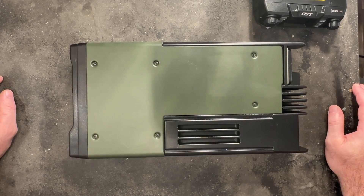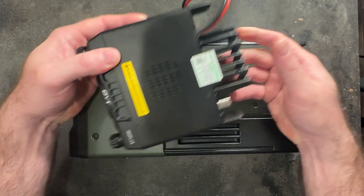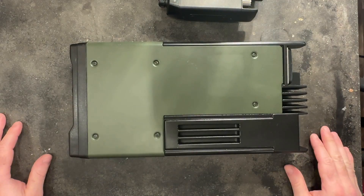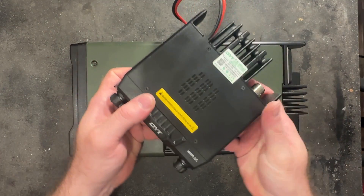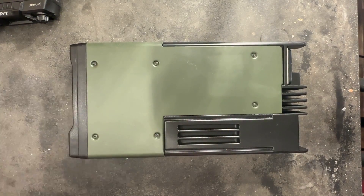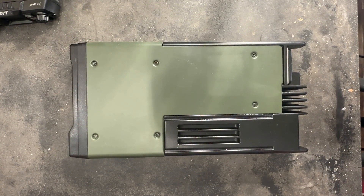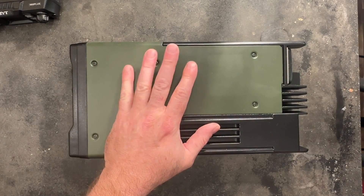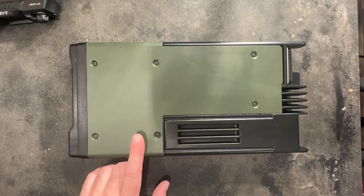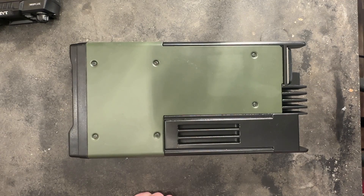The really cool thing about this radio is that because it's rated for 100 watts, the duty cycle — just to give you an idea of the size comparison — most of these radios have a duty cycle rating anywhere between 20 and 40%. That means with a 20% duty cycle, you're transmitting 20% of the time and receiving 80%. This commercial radio has about a 40% duty cycle on high, but an almost continuous duty cycle on the low setting, making it ideal for the transmitting section of a GMRS repeater. It's just a heavy, heavy-duty rig.